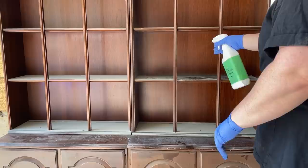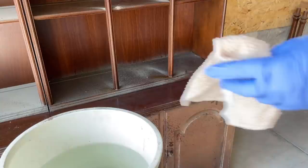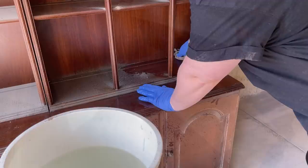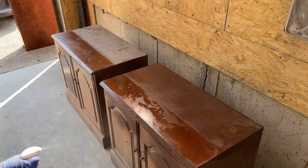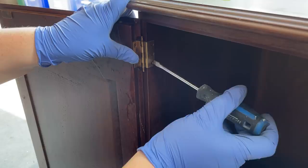My first step on this piece, which is covered in dust from painting in the garage, is to clean it. I'm using some TSP, which is a really heavy-duty degreasing and deglossing cleaner. I mixed up a whole batch of the crystal TSP with some warm water in a spray bottle, sprayed it all over the piece, and then wiped it back with some warm water. It's really important after using a strong chemical cleanser like this to go back and wipe everything off with clean fresh water to remove any residue.